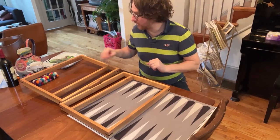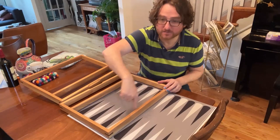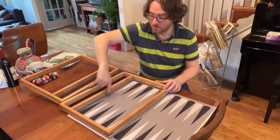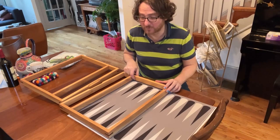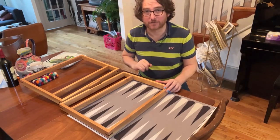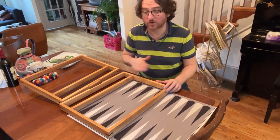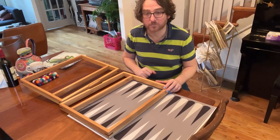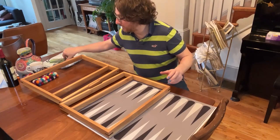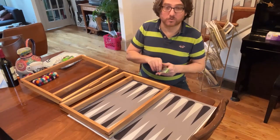And then I'm going to run a knife around the inside edge of the frame. So in theory, that will give me a cutout that's exactly fit to that frame. And then I'll label them up so I know which one's which. And that should help us avoid gaps around the edges or it not fitting.